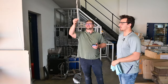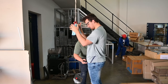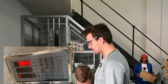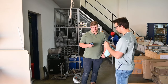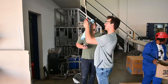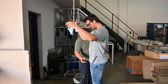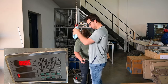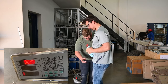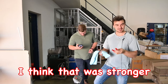Moving on to the second one, which is going to be PETG. On the scale, starting weight 90 kilos and pull. That actually went earlier than PLA. Okay, final test is PLA+. On the scale, 90 kilos and pull. Jeez, that held out way longer than the previous ones. PLA+ — I think that was stronger than the others.